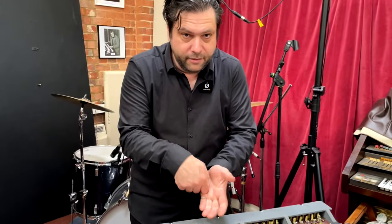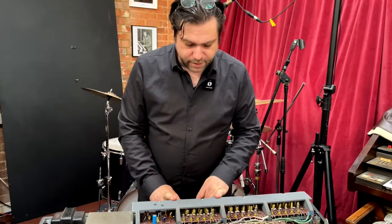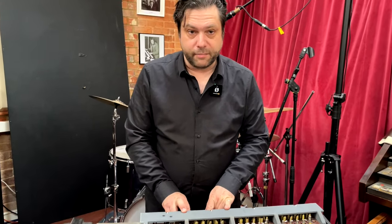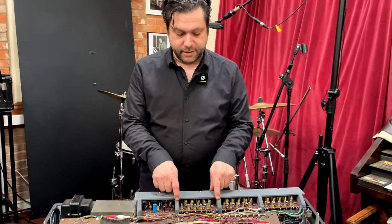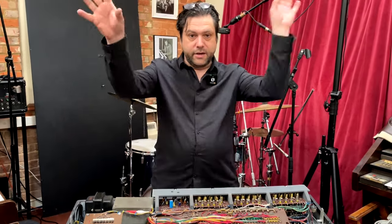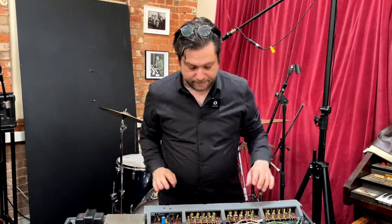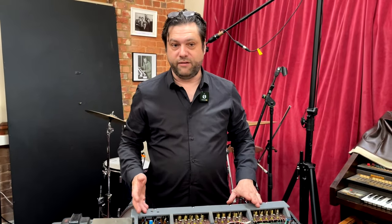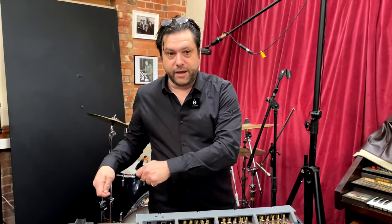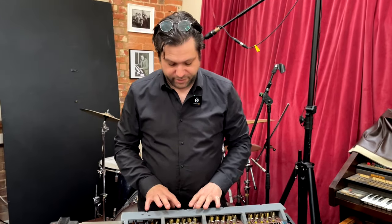So it's good to go over them with a tiny bit of the soldering iron just to make sure that they're all connected. Sometimes that actually clears problems up, because you can imagine this thing has been bashed around over the years, and with every vibration a tiny piece of solder flakes off, and the older it gets, the more brittle it is. Ideally, what would be nice is to just completely suck all the solder off and then redo the whole thing, and it would probably be as good as new, well, until the life of the components runs out.